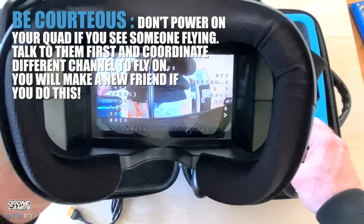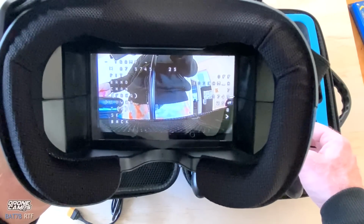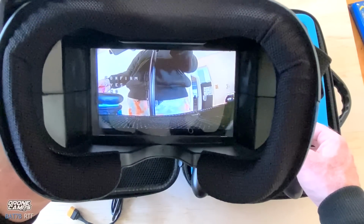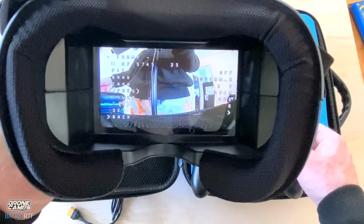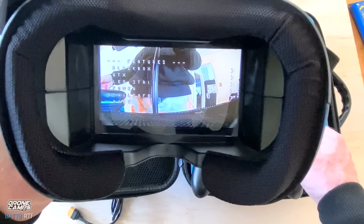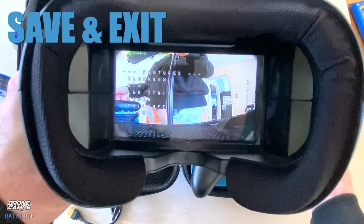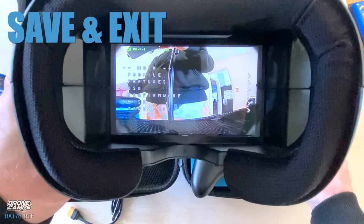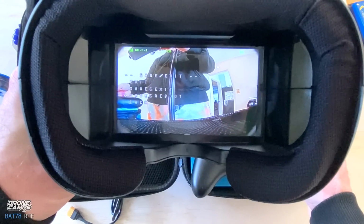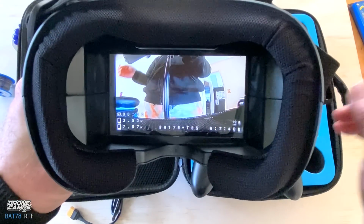So we can change the band and channel here. Also the power is super cool, up to 400 there. It says 25, so we'll change that up to 400. And now we'll set and say yes. And now we'll go back, and you want to go down to save. So make sure we save that. So we're going to go back again, and we want to go save and exit. And one more time, save and exit. Okay, now it is on 400 milliwatt for sure.